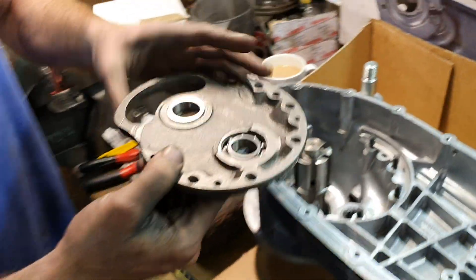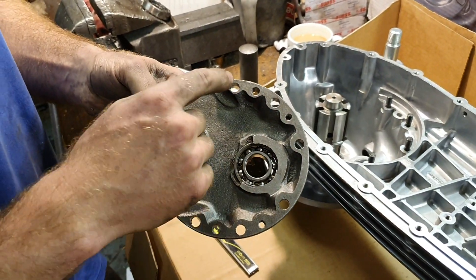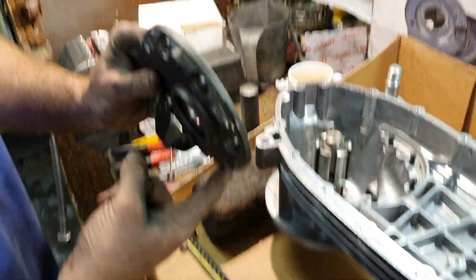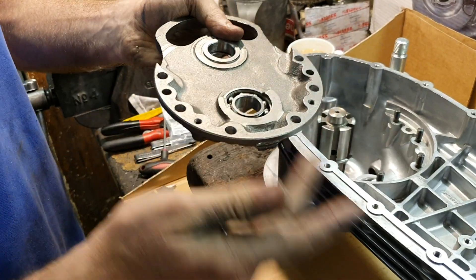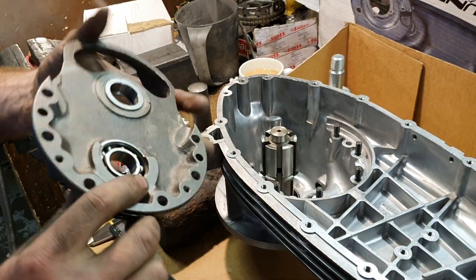On this one I've drilled out each of the six positions from 7.5mm to 8mm. Sometimes they'll need to go up to 8.5mm in order to get enough float. Sometimes you'll even need to file the front of this surface here if it happens to be touching on the inside of the casing. Always make sure you clean that chamfer up again if you have had to do this, because the edges can catch and mean that you get a lift where you shouldn't.